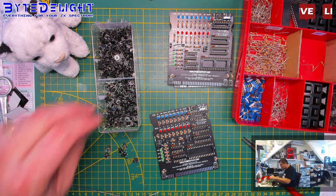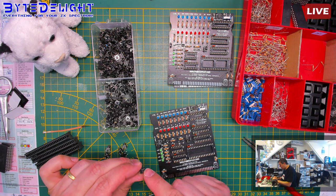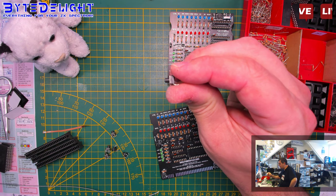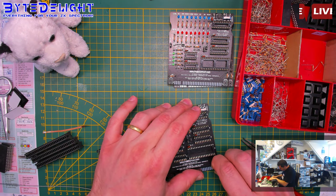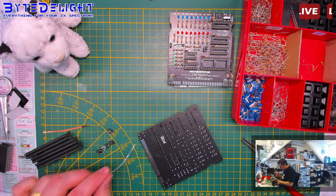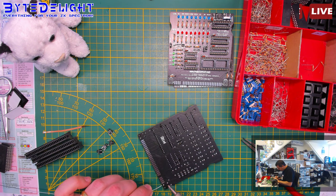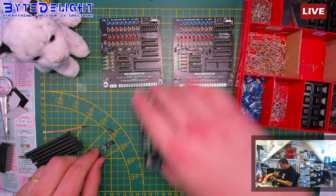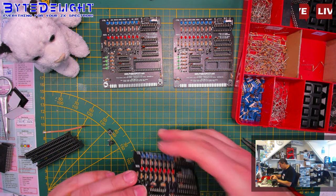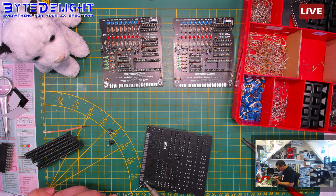So these are the 7mm, and I don't like that they actually measure the size from the bottom of the button, because I would prefer if they measure it from above to bottom, but anyway, that doesn't matter. Because you can actually see that the part sticking out is not 7mm, of course. But who cares? And the reason I'm saying that is that sometimes it's hard to order the correct ones from China. They're quite cheap there, but sometimes you get a model that's 1mm longer or shorter, and it could cause problems in interfaces where you want the button to stick out, but not too much. It's no problem in this interface, of course. You could use any size here, even 12mm or something. I have longer ones. I have very long ones.